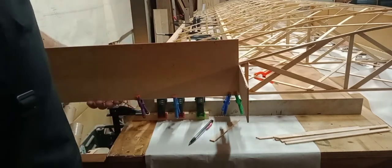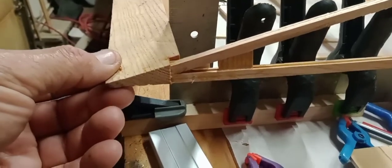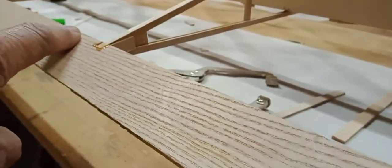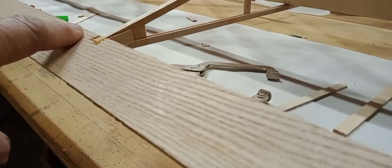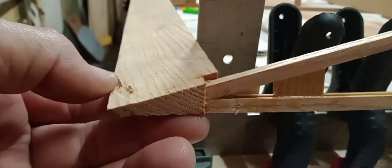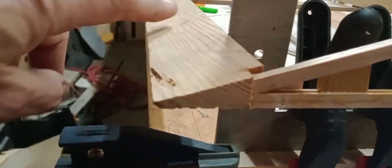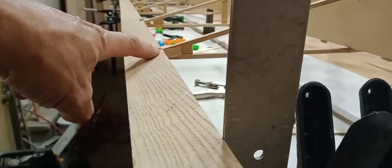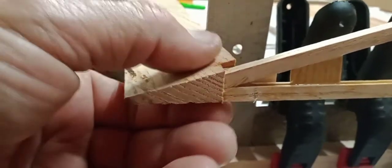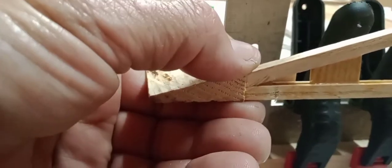Here we go — that was simple. Now as you're going, you're going to find little anomalies like this that you'll want to repair. I'm going to go ahead and get some real heavy grit — probably 40 grit — on my belt sander. It's not too bad here, it's within less than a sixteenth of an inch — probably thirty-one thousandths, one thirty-second. But this here is a good eighth of an inch at least. So I'll go ahead and blend it — I might even start from that rib and blend this down. This is the only one that's really like that. It's the outer edge of the aileron, and it's also where the wingtip bow comes.